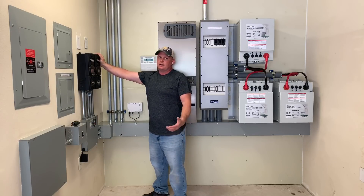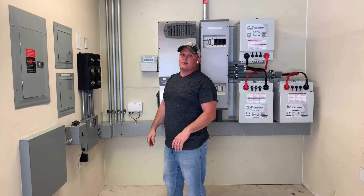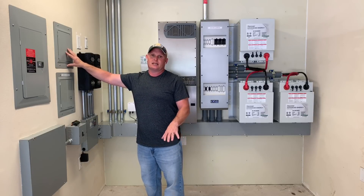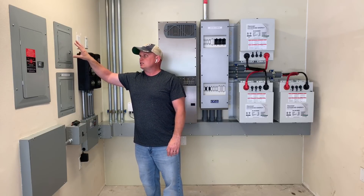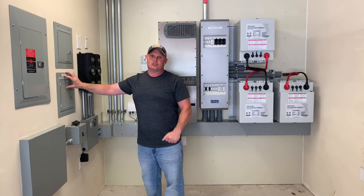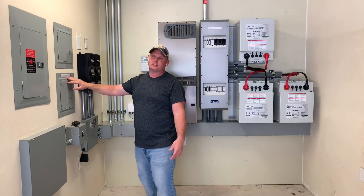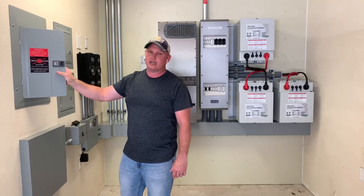Stepping over this way, these are the original charge controllers for the system — Outback MX60s going on 14 years old, and they've been working great. When I first built this, it was my first system ever — about 13 and a half years old now. One key consideration was that we have some 240 and 120-volt pumps, and at that time the inverters were 120V so you had to use a stacking cable to get 240 volts. We did a bypass assembly so we could run the well panel directly off the generator in an emergency. Now that we have a 240 split-phase inverter with bypass, we simplified it — this is just a well panel and generator input panel, which also allows us to feed another inverter if needed.